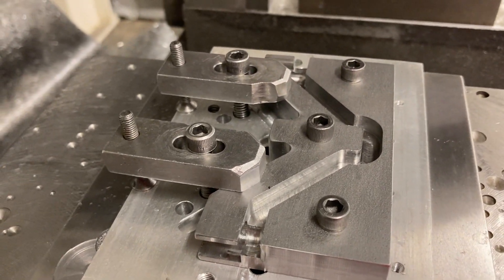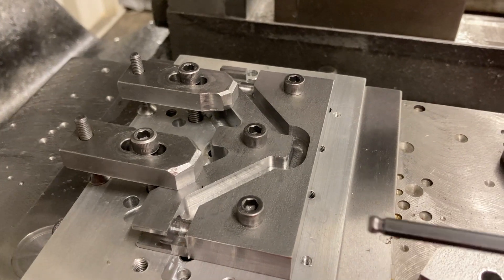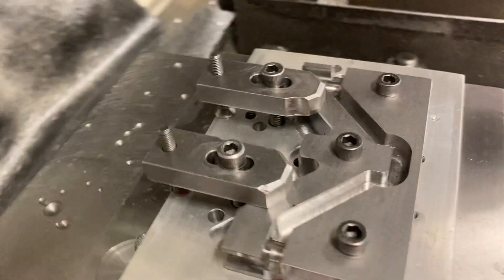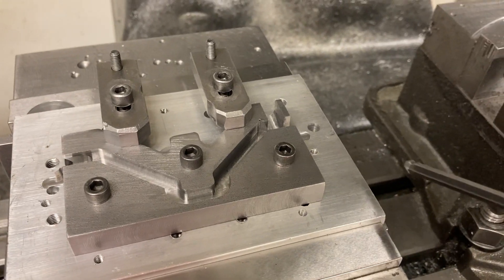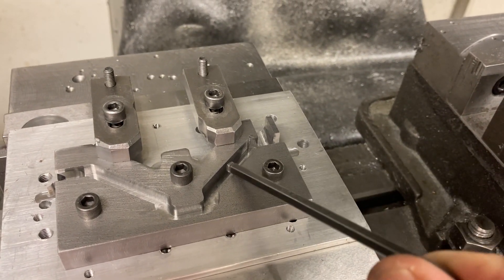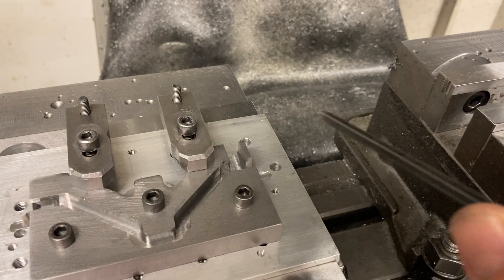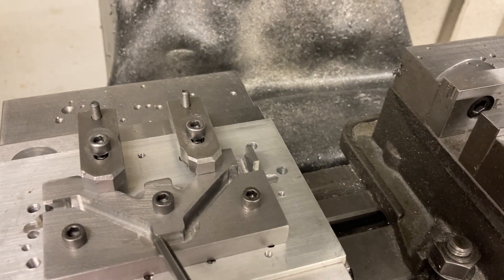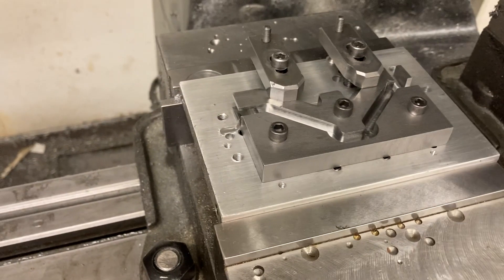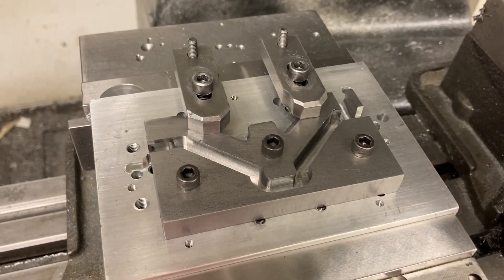When the end mill comes in — I already took one cut, already went a quarter inch through — I'm using a solid carbide OSG four-flute stubby end mill with a half-inch length of cut, just enough flute to cut through this piece of material. I took the first pass a quarter inch deep, chopped through one pass. Now we take the next pass. It stays five thousandths away — it has a finish pass. So it comes in, cuts all this out, goes five hundred thou deep, then comes back and takes the last five thousandths off the edge. Then we unscrew this, take that away, and you end up with the V-block clamp.